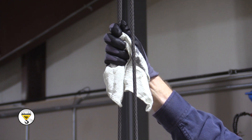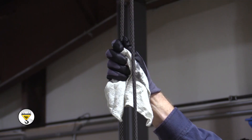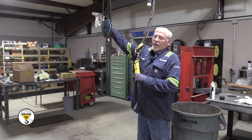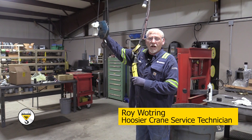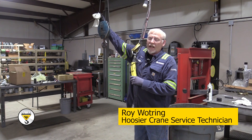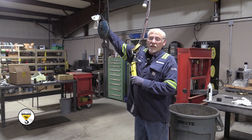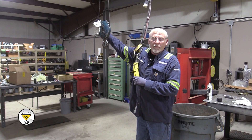In summary, doing your cable inspections and your chain inspections are required by OSHA to be done monthly. While doing them, you're looking for any kind of broken wires or any kind of deformation that would cause the cable to break. If you get a kink in the cable it has to be replaced — anytime there's a physical mark on the cable it should be replaced. This is required by OSHA.